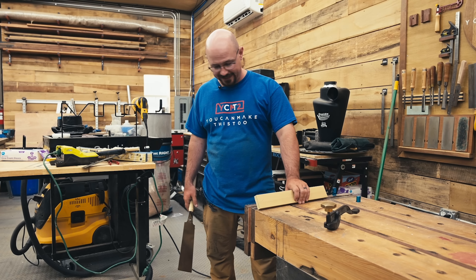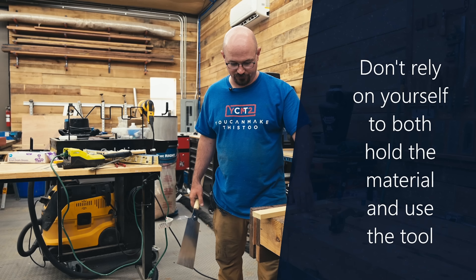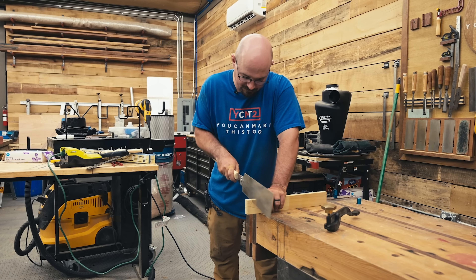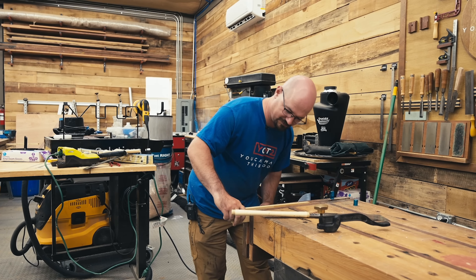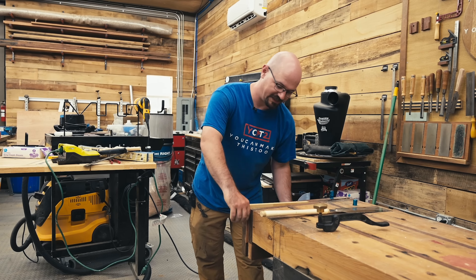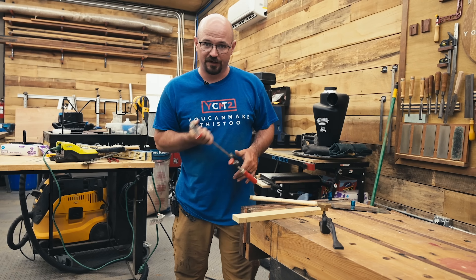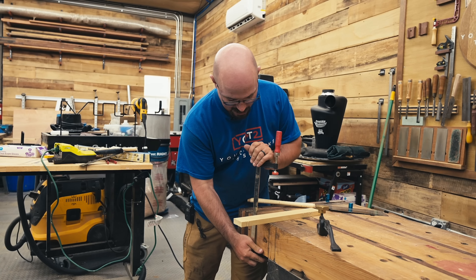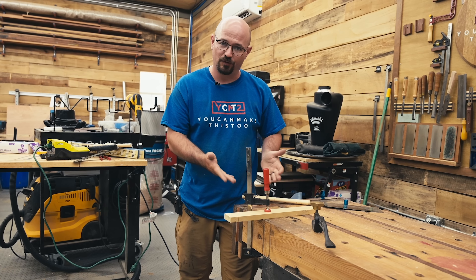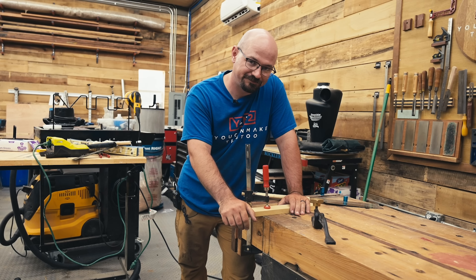Even if you're just doing one cut, almost any time you take a tool to a piece of wood — hand tool or power tool — don't rely on yourself to use the tool and hold the material at the same time. It's just not going to go as well as if you vice it or clamp it. You don't have to have any crazy setup; a lot of workbenches I built before this one, I always made sure the top hung out a little bit so I had a lip I could easily clamp things to. If you have a few clamps — and if you're woodworking, always have a few clamps — use them to hold your pieces. Just clamp it down; makes life a lot easier and you'll get better results.